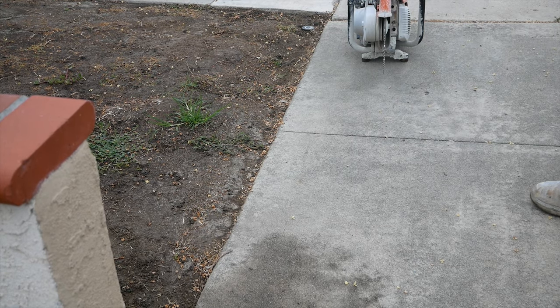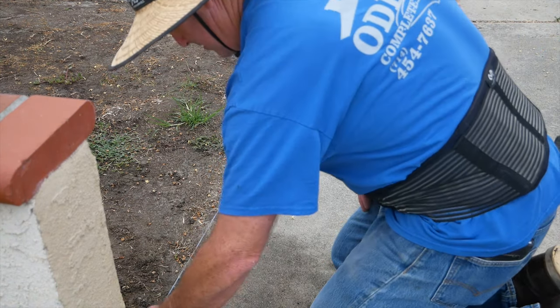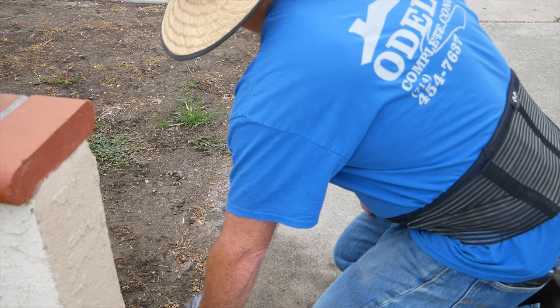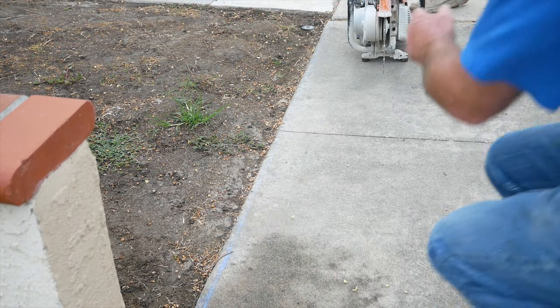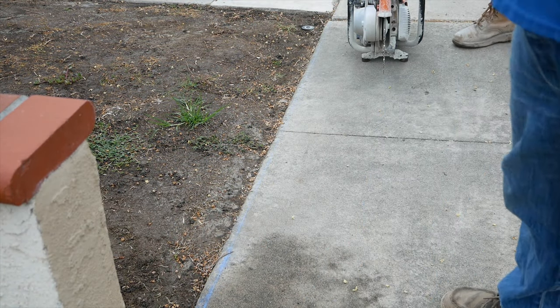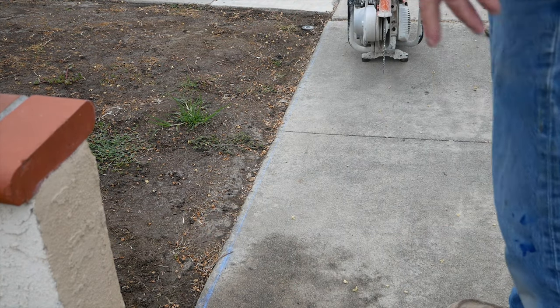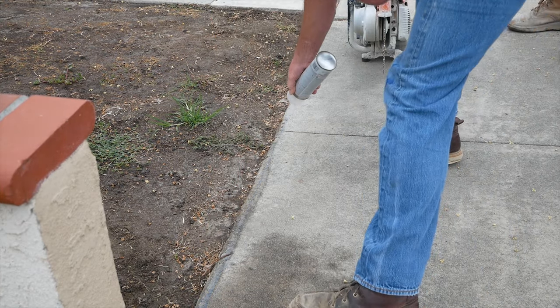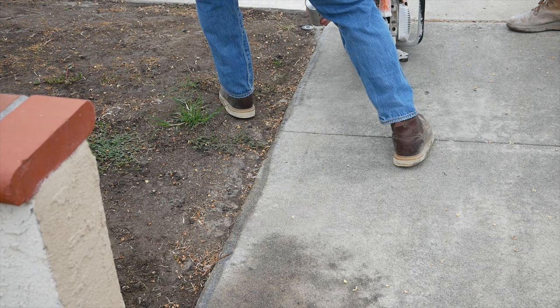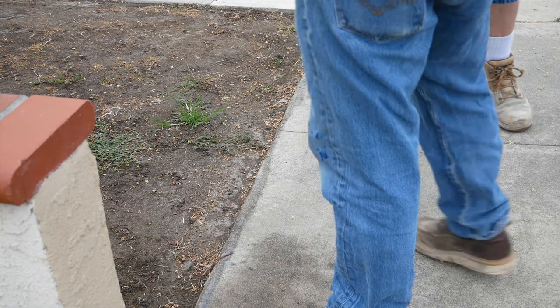That's my brother Douglas — he snapped the line on there. He's going to spray some clear lacquer on there and that'll preserve the line even with the water running on the saw, so he'll be making that cut while I start breaking the concrete. That upside-down clear marking spray will preserve the chalk line.